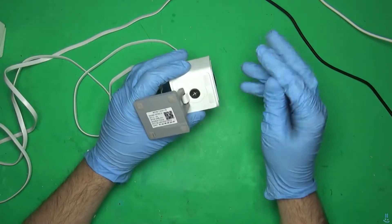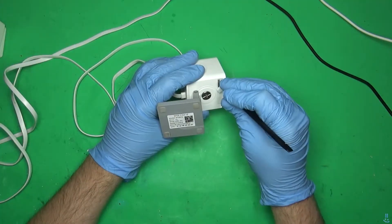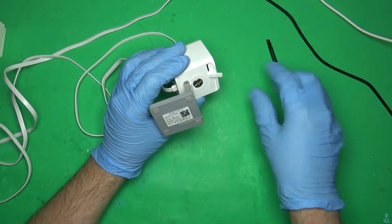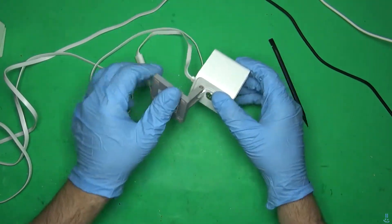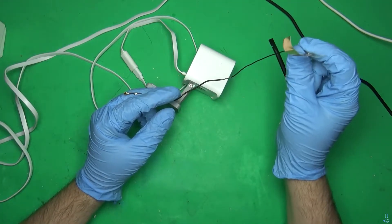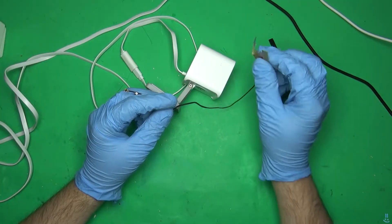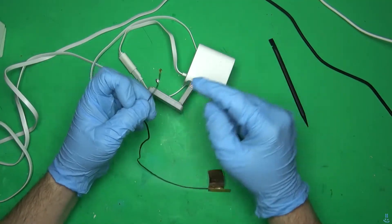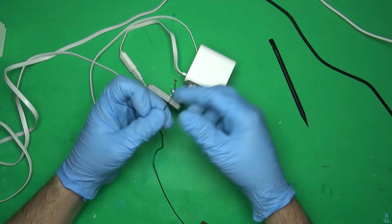There was a gentleman — I think his channel was Roger S — and he did a video about taking these things apart and putting an external antenna on it. I don't really want to do an external, so I want to put a different internal antenna. What I have is an antenna out of a laptop that goes into the lid. The laptop did 2.4 and 5 gigahertz, so this should work fine. I was going to put a connector on it, but I can't find it, so I'm just going to cut it off and solder it right to the board.